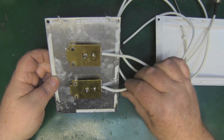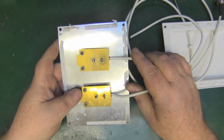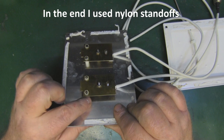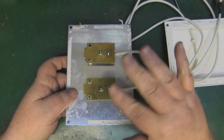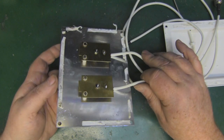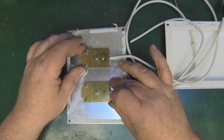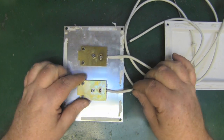This is a shorted panel design. The notch on the element is probably there to bring the impedance down to 50 ohms to lower the VSWR — a classic design feature with panel antennas. It's not as nice-looking as the 5 GHz antennas were, but as we saw on the network analyzer, they certainly do perform at 2.4 GHz. Converting these into reference antennas is going to take more work than the 5 GHz ones.